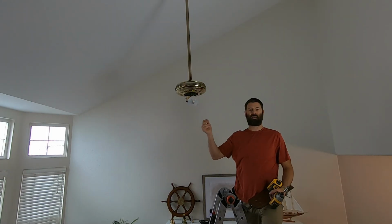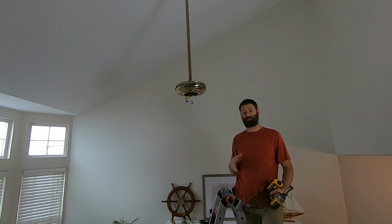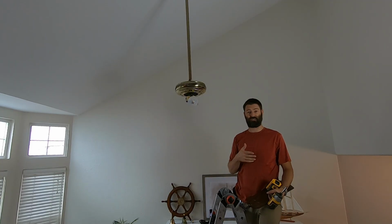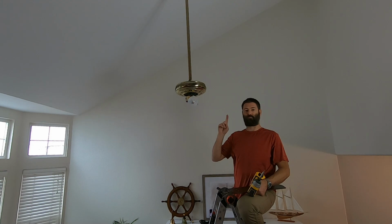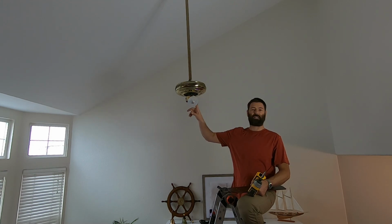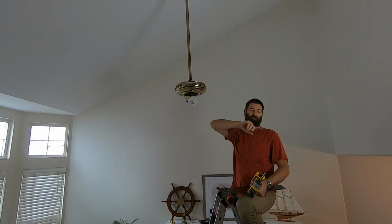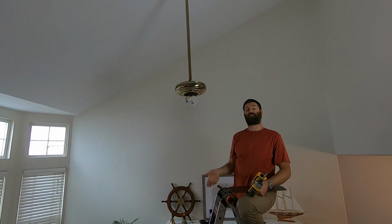The way that you hook the wires up may be different in your house. Battery went dead, so it's probably a good thing battery went dead. I didn't show you, so you have to read your directions. For this application, the blue wire is the light, and that goes to the red wire. So there is a 3-wire from the switches, and the first switch is usually the light.